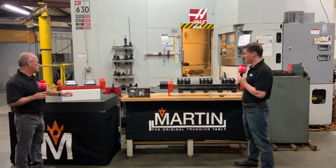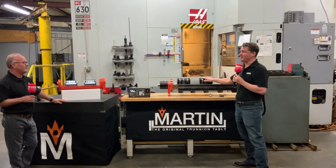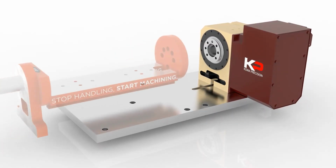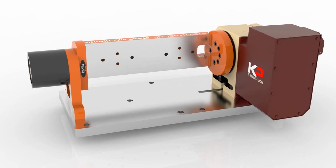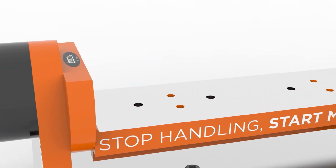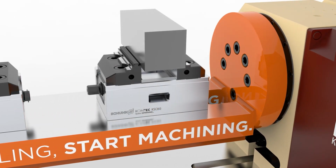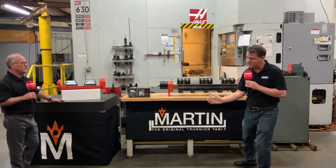Well, that makes sense to me, Stan, and it makes sense on multiple levels, like an onion. Our entire spiel to the great people watching right now is to keep that spindle running, to machine multiple sides of a part, to not load and unload, to reduce the tool changes. So the ultimate goal is to get more out of a day, or allow operators to run multiple machines throughout their day. Now we're adding something like this Schunk vise, a pneumatic vise, which allows a robot to get involved as well. So we're taking the concept one step further to automate it even more.